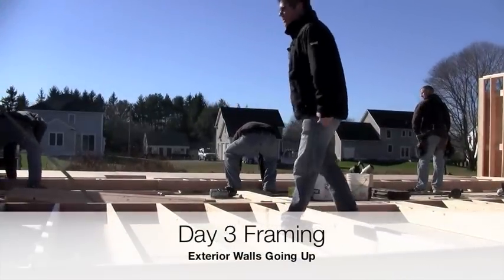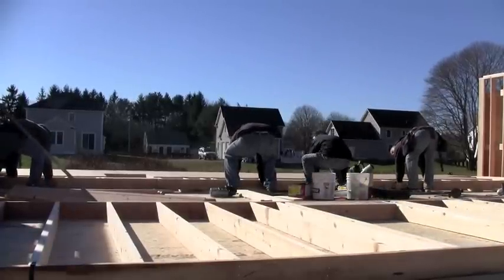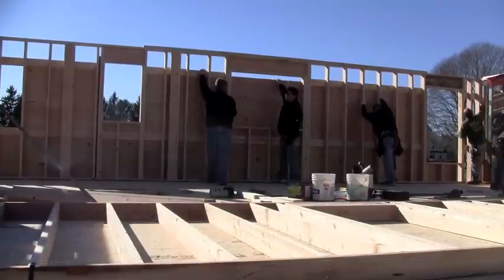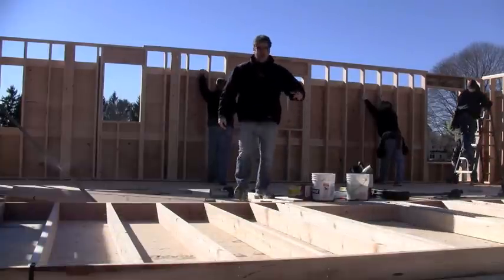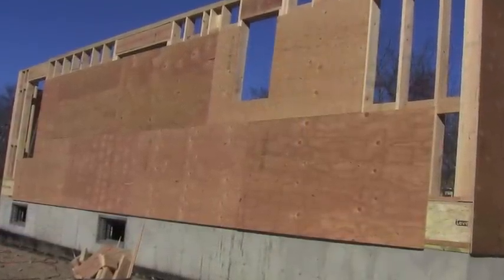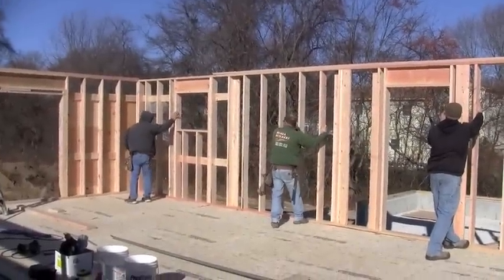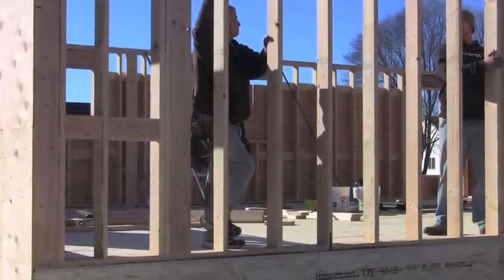Right now we're excited — we're putting up the walls on the exterior of this house. Yesterday we were putting the subfloor down. These four guys are going to pick up the wall. These are 2x10 headers — they're not LVLs. We got the exterior wall up, nail it in tight, make it level. The other wall is going up — this will meet the garage area. Now we just got to level it off and throw in some straps.